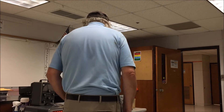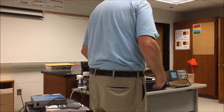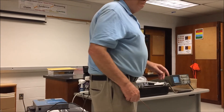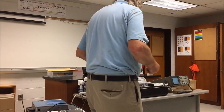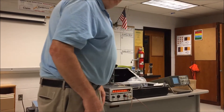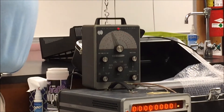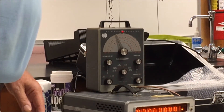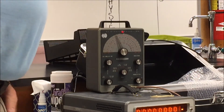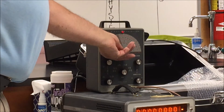The scope really is the best thing. The third item on the list should be a signal generator, so you can generate signals and inject them into the receiver, align your IF. It doesn't have to be really fancy — you can spend $2,000 for a nice used HP or Agilent, or you can find a Heathkit unit for $10. This one does work; I did have to spray DeOxit on the switches because they were a little dirty. The problem is these things are not too accurate — you just kind of dial in the frequency, so you won't be right on 455 kHz.